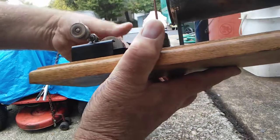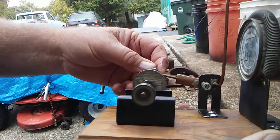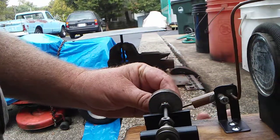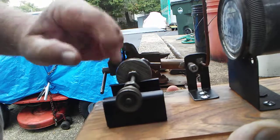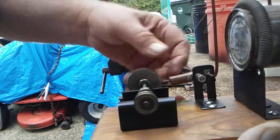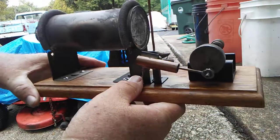Here's the way it gets its valve action. When the cylinder is up like that, it's on the exhaust stroke. It turns counter-clockwise looking in from this end. This is the push stroke, this is the exhale. On exhale, it lines up with a little bitty hole back there in the back. Then the momentum of the flywheel makes it coast on around, and the same hole starts lining up with the steam line, which pushes it out. It just keeps repeating those two things. So I guess you'd call it a two cycle — I just call it a poor man's El Chippo steam engine.